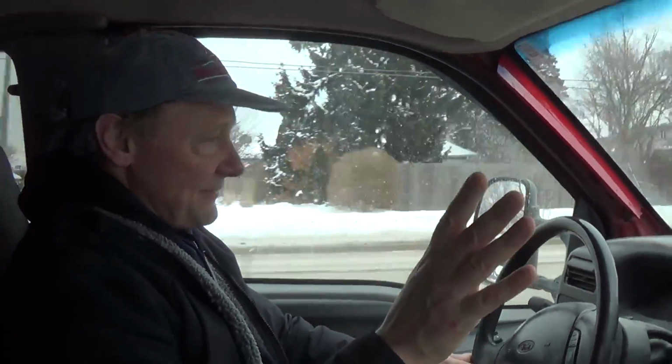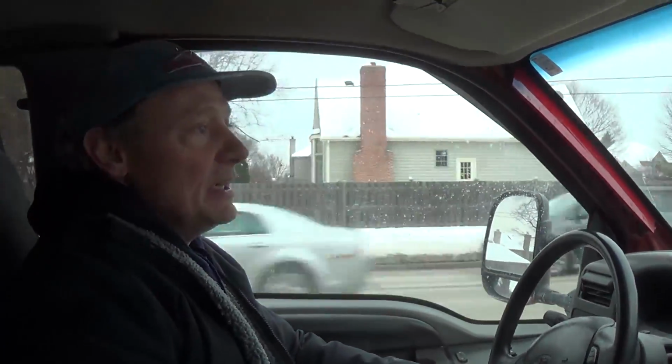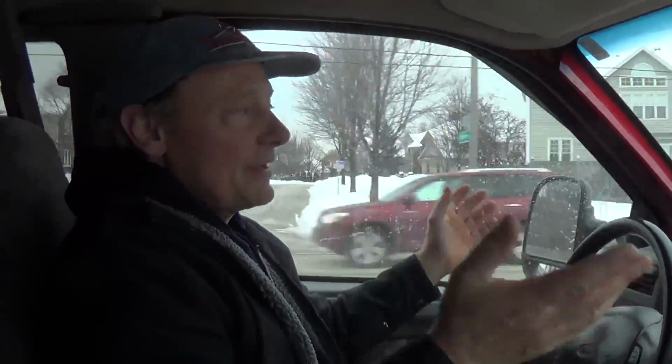We used to tape these garages up here for fire code in the dead of winter, freezing temperatures. We'd tape it, we'd roll it, and then we'd scrape the mud off of the angles. We would tape and have to wipe right behind the tape on all of the seams. And we would get it all taped, and everything would be frozen solid. Minutes after we get done taping, it's frozen. Come springtime, all the tape falls off the walls. So we have to go in there and retape all of the garages come springtime.